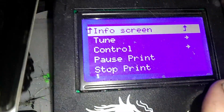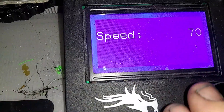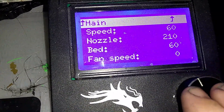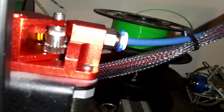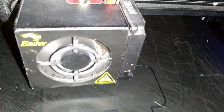It's starting now. So I'm going to go ahead and tune this because I originally set this print to be printed in regular. But all you've got to do is come in here and tune it. We're going to see how it does on 60. This is the first bit of TPU so it's going to take a second for it to probably come out. Let's see the cogs turning — and there it is pretty. So good so far.